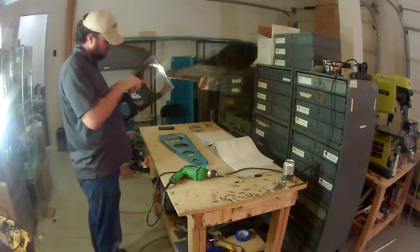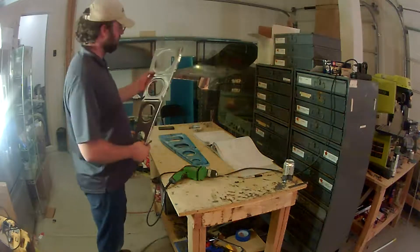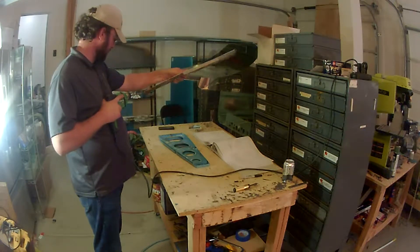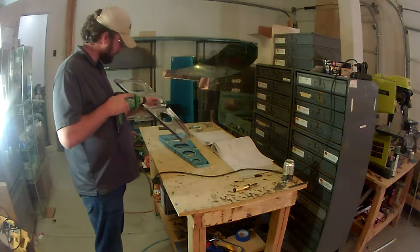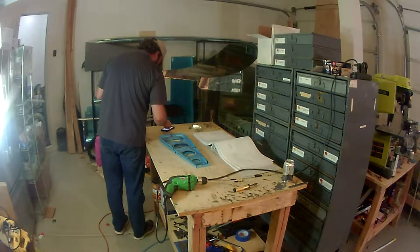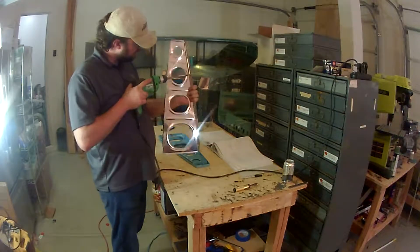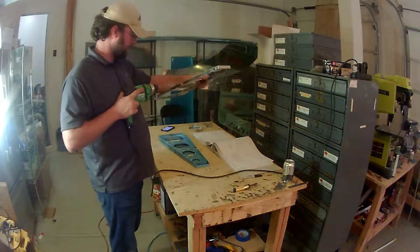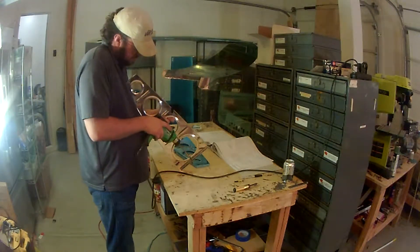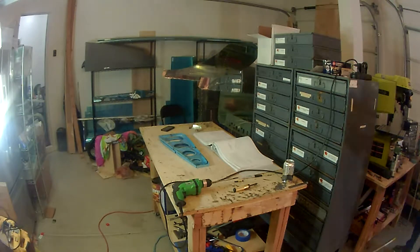Once you get that prepped, you start working on ribs, and there's quite a bit of work to do. There are 14 ribs per wing, so I've cut out most of the monotonous prep work footage. It's a lot of deburring and things like that — you've seen it before. Essentially, just like anything else: get rid of rough edges, file everything down, remove burrs from the holes and lightning holes. Then the instructions have you check all the flanges to make sure they're close to 90 degrees.